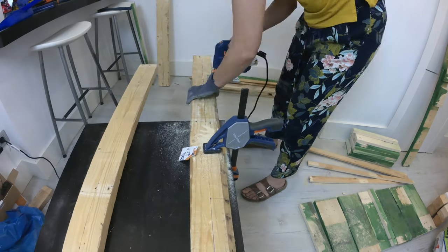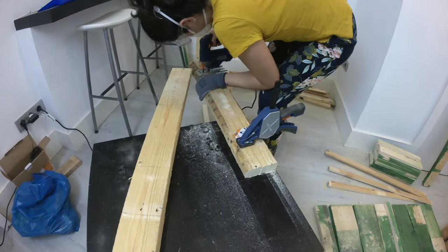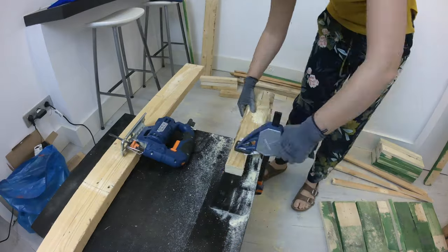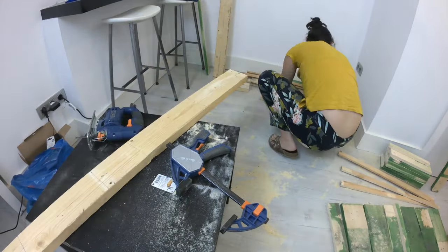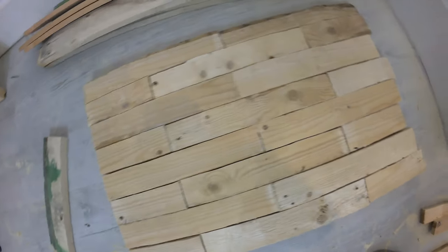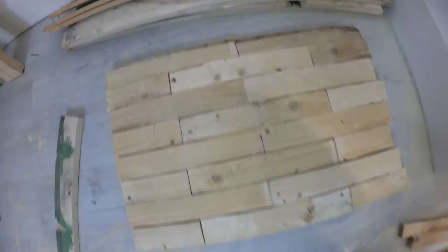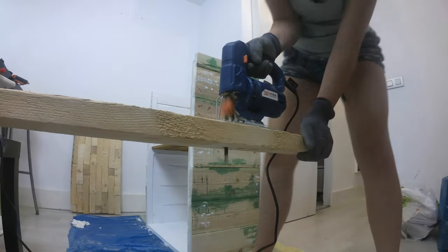For the top, I decided to go with a sort of butcher block, cutting the thicker boards in half lengthwise and then making shorter blocks to create an intermittent pattern. If you watch closely, you'll see that I'm switching between two halves on the first row and two quarters and a half for the next row. And while you are here, you can also cut the other two inch board in half, which will later become the support for the upper shelving.